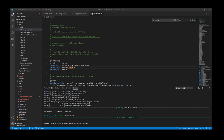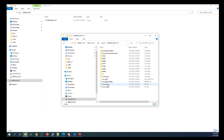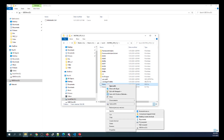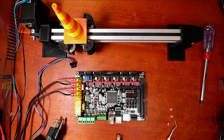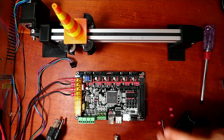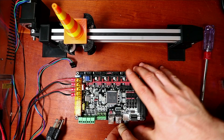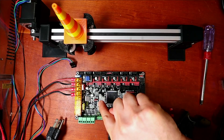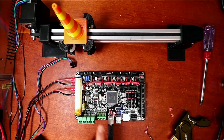Here's the folder where our build took place. To move this to our drive — which is the USB D drive — we're going to right-click, go to Send To, and send it to the D drive. That's our firmware.bin. Next we're going to go over to our workbench and install it. I'm going to pop the drive out, bring it over, slide it back into the board. Now that it's in, I'm going to connect the USB serial. I'm going to connect the power and the firmware will begin to load — you'll see a flashing light. Remember not to touch your board when it's energized.